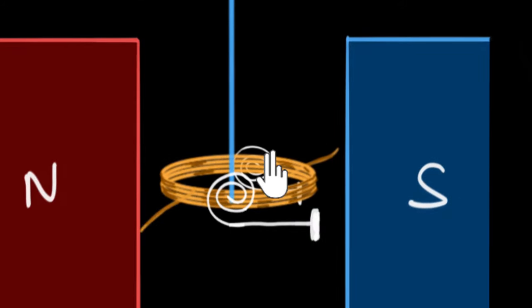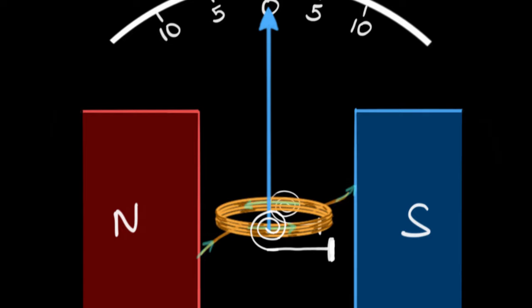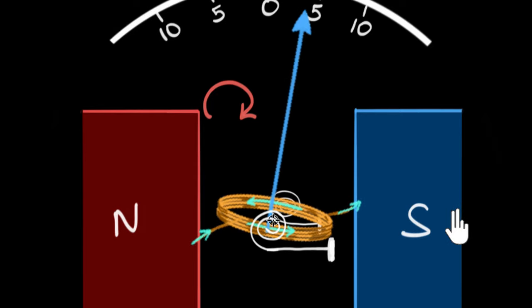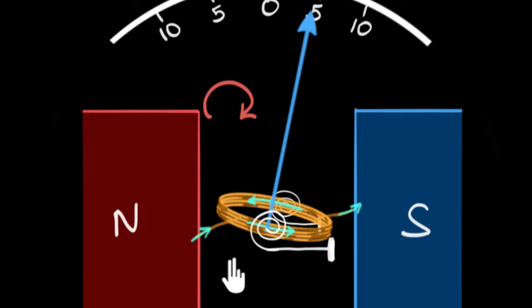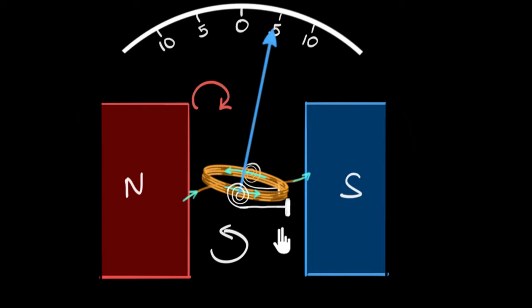We attach two coil springs — two for stability. The ends are fixed and the other end is attached to the coil. Now if we run a current, the coil acts like a magnet, a torque acts on it, and it starts to turn. But as it turns, the springs get coiled up, and as a result they tend to uncoil themselves — putting a torque in the opposite direction, the counter-torque. At one particular point, the torque due to the magnetic field and the counter-torque balance out, and the pointer stays stationary. Problem one is solved.